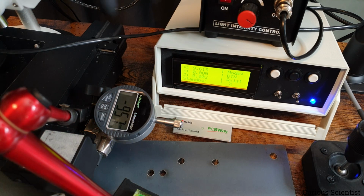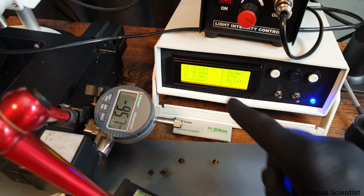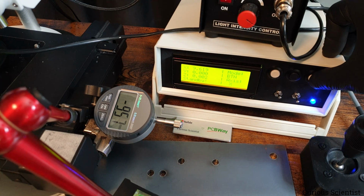The principle in the box is just using the number of steps from the motor and the pitch of the lead screw that moves the stage. So that's a pure mathematical formula. And this one is whatever equipment, but we don't know its accuracy. Despite these unknown things, the discrepancy between these two is just 50 microns. 50 microns is the thickness of a human hair. So I don't really care about that difference. We get reasonably good numbers on the display. That's what I'm trying to say here.